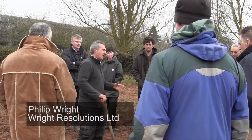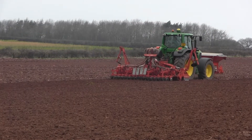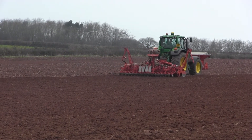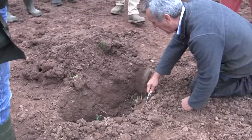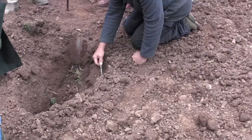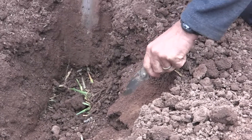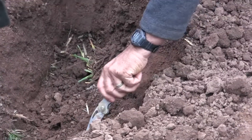The particular thing we're doing here was to look at one of the standard methods of crop establishment and assessing the effect of different tire pressures on the drill tractor. Looking at the higher pressure one here, we've powered it down to about this depth and it's a nice crumb. Once we get down to the level in line with the actual wheel of the tractor, the high pressure has created a slightly looser bit where the eradicator went.